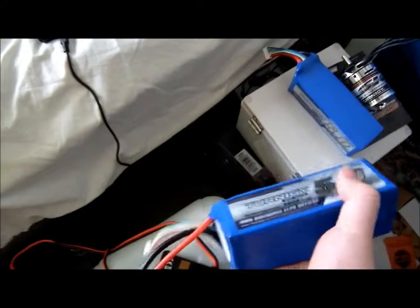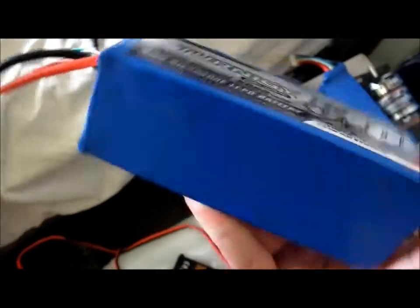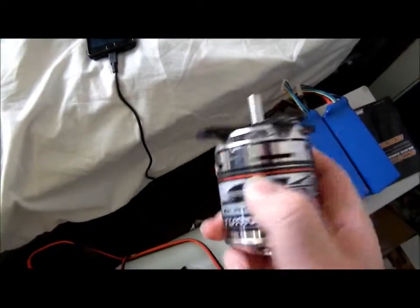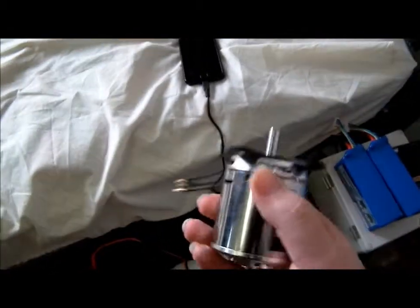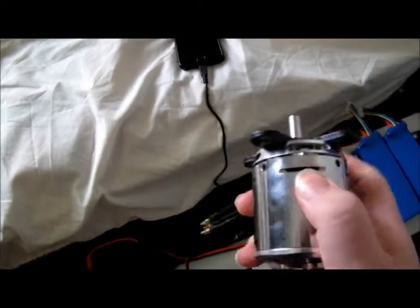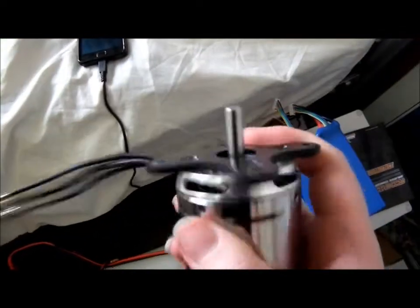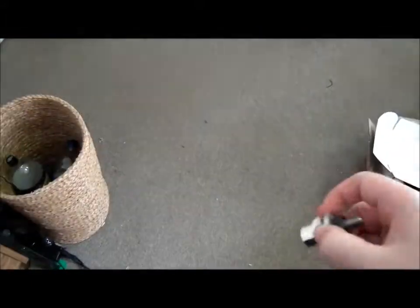Apart from that, I got two lithium batteries — just two for now, I'll probably get a third later. They're 5Ah 6-cell packs, so there's two of those. And also the motor — it's crazy to think this is actually 2.7 kilowatts. It's about a kilo, but compared to the brushed motor already in there it weighs basically nothing and it's actually smaller too. The power density of these things is just insane.